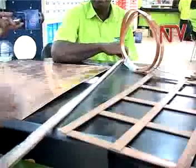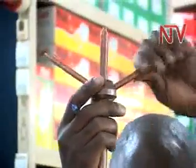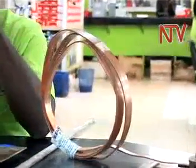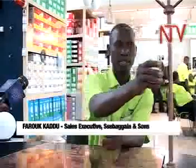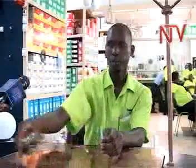Installation technicians advise that when buying the device, be careful to choose genuine suppliers to avoid substandard products. A genuine lightning conductor must be copper plated to effectively arrest lightning. If you test it with a magnet, the magnet will attract a non-copper item, but will not react to genuine copper — that's a good test.